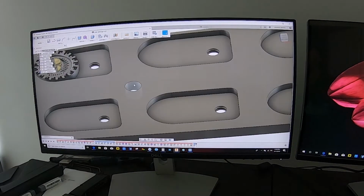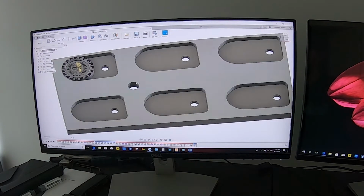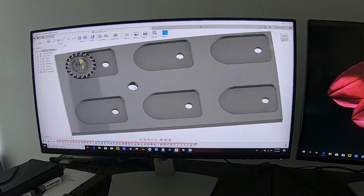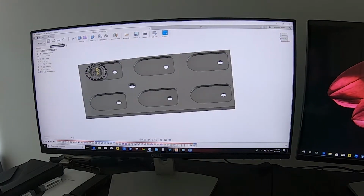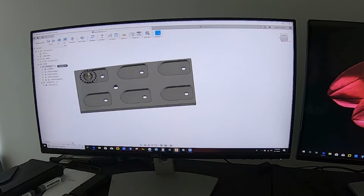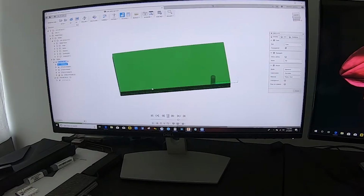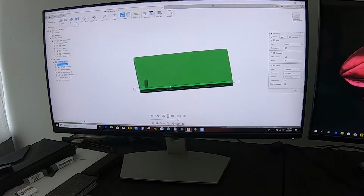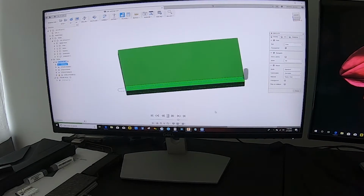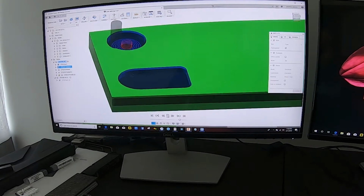So this hole is just to reference geometry, right? So this is a machine hole. So what we do is reference our geometry, meaning when we put it in the machine, our first op is going to be pretty much just face it off. Right now, all we have on hand is an end mill. We're going to face it off. Boom, boom, boom, boom, boom. Then we're going to come back and clear our pockets with an adaptive, full depth of cut.